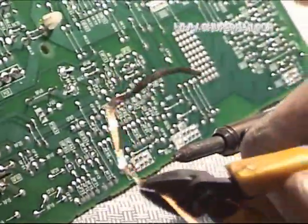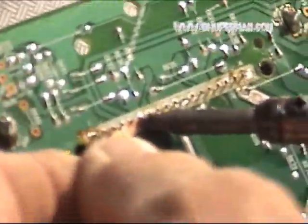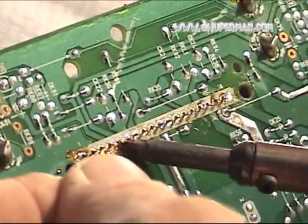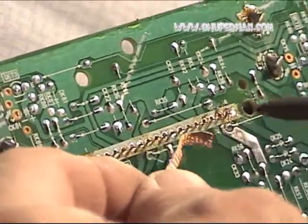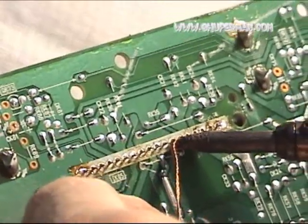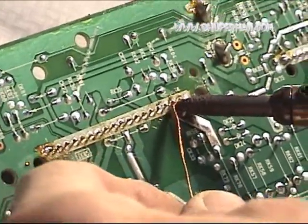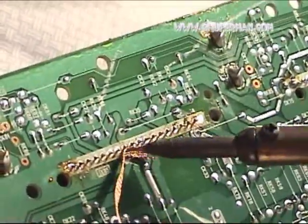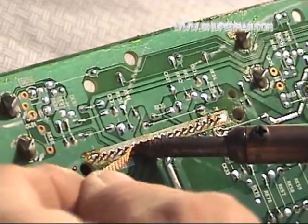You see how it's darker right there. I'm going to cut it off right there because that wasn't working. Now I'm going to get back to this. It was like that because that's where I had been handling it. I cut off the solder wick in an attempt to troubleshoot what's going on with the desolder operation — it's not working quite the way it should, but we'll continue on. I've noticed in the past that wherever I've handled the solder wick, apparently the oil from my hands contaminates the flux, or somehow removes it, so it doesn't seem to work as well after that. That's why I cut the piece off the end — it looked like it had been contaminated.